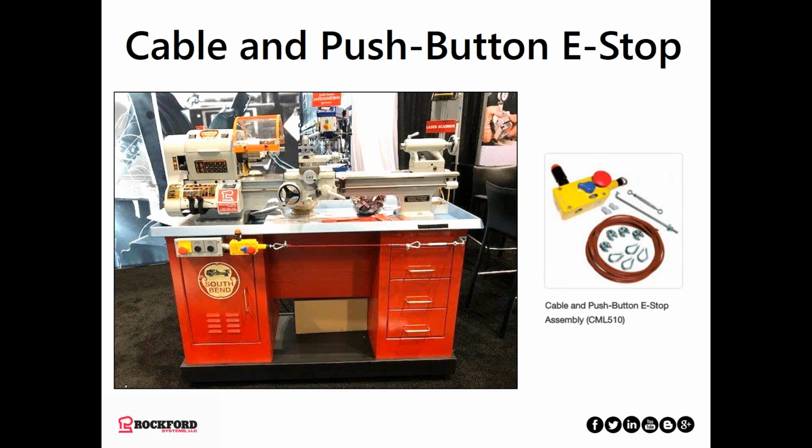There's an engine lathe, a small one sitting on a movable stand because it's used at tool shows, that has a couple of different emergency stop buttons, as you can see here. One here, and a cable. It goes all the way across the front, referred to as a grab wire or a rope pull e-stop button. It's also got one of those interlock chuck shields we mentioned before, and the rotating components are covered over here and have an interlock switch right up there, so if you open that cover, you disable the machine.